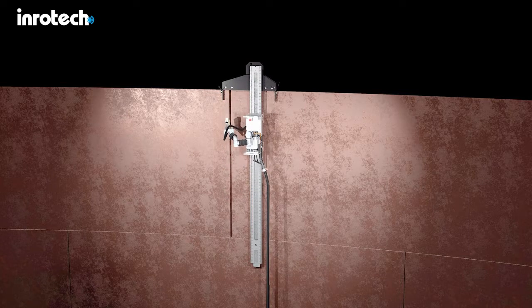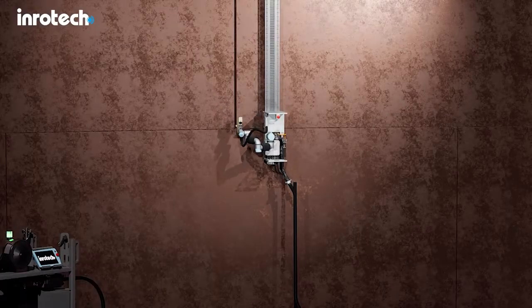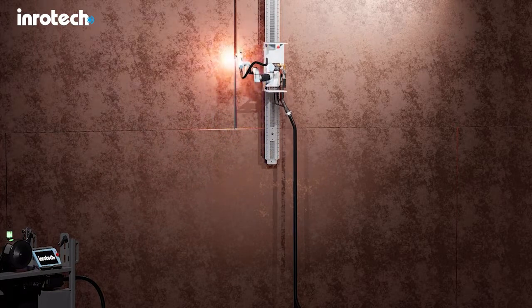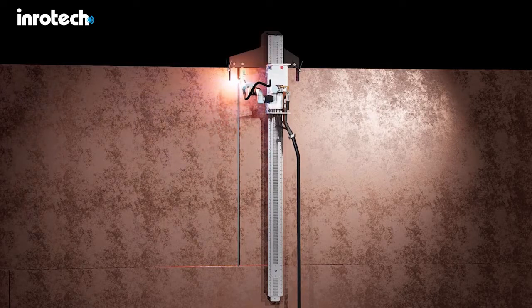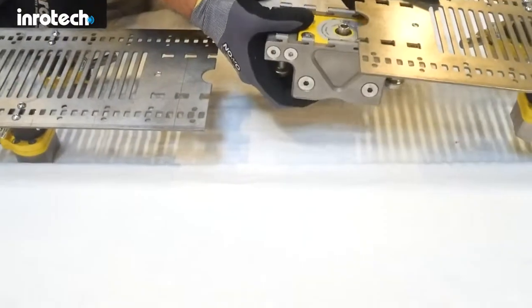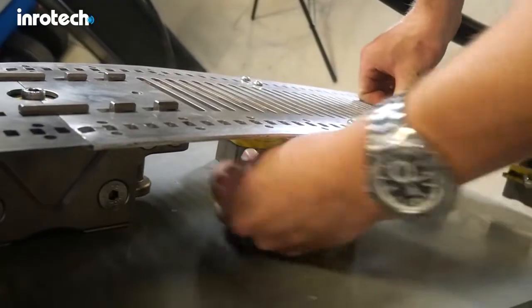It is also possible to weld the horizontal connections. The only difference is the rail system, which for that purpose is a modular flexible titanium rail, which is fixed to the steel plates by means of switchable magnets. Each rail has a length of 3 meters and can be interconnected easily by a snap lock system to any desired length.